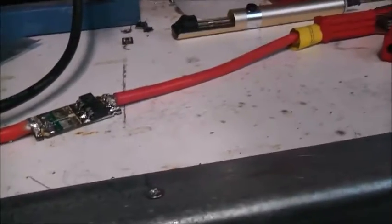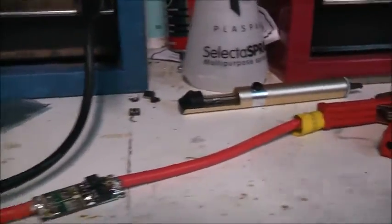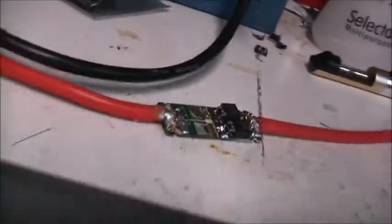There's plenty of solder in there - not as much as there was before, but it will take the current anyway. Even if it does fail again, it'll blow like a fuse. It's either going to blow the FETs again or blow a fuse. The way I've soldered it there's not enough solder there, but I think that's a pretty damn good join. That'll still take a lot of current - even if they fail short, it's going to blow like a fuse either way.